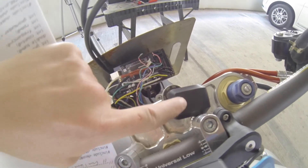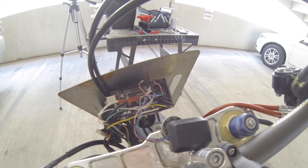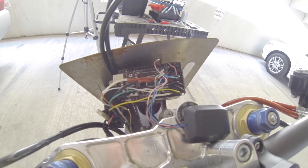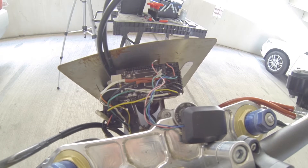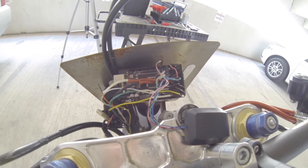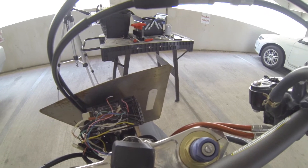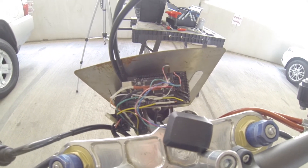For the speedometer, I've got a little GPS receiver. One of the wires stripped out there — I'll need to solder that before getting this back together permanently. The GPS unit I had to reprogram to parse the information I wanted and get the signal updating as frequently as I needed. The blue wire from it goes to D17, the red goes to the 5-volt block on the board, and the black goes to ground. Right now it's just stuck to the back with a little velcro. When I eventually build a housing, I'll find a way to get the GPS unit inside so it's not swinging out in the breeze and prone to falling off.